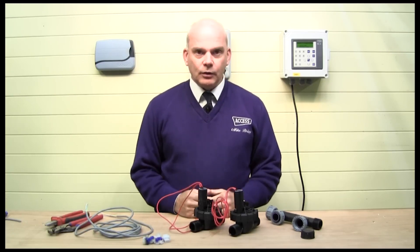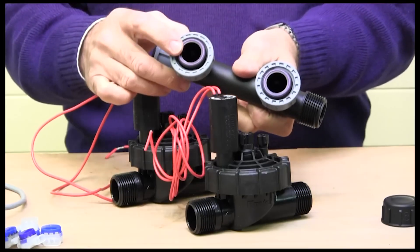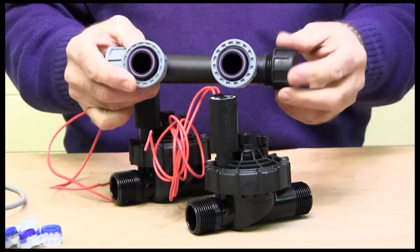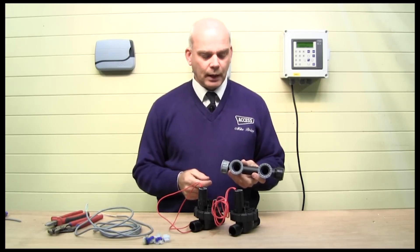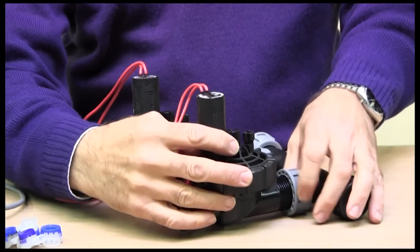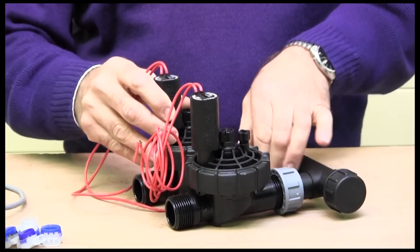The beauty of solenoid valves is that they're very easy to assemble and wire. We do manifold fittings here — little manifold assemblies — there's a two, a four, and a three-way. They've got an internal seal; the end stop is usually capped off. Anything up to one-inch BSP male can go in — 25mm, 32mm, or whatever your supply pipe size is. These Hunter valves have a one-inch male on both sides, so you simply screw them together, making sure the solenoid valve is the right way round.